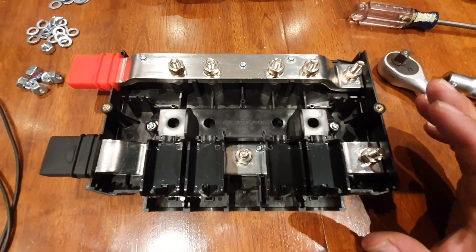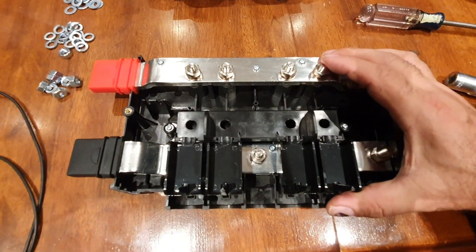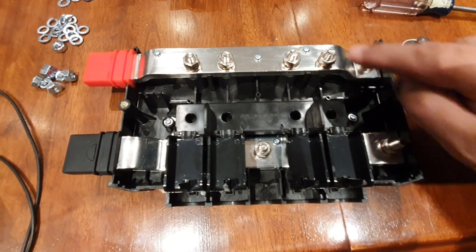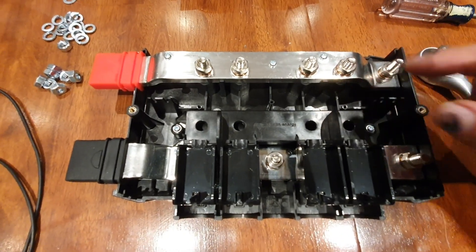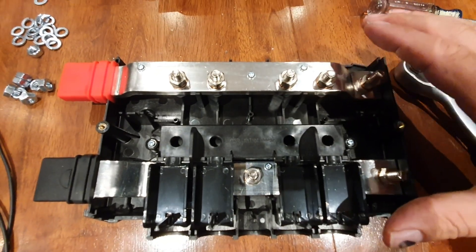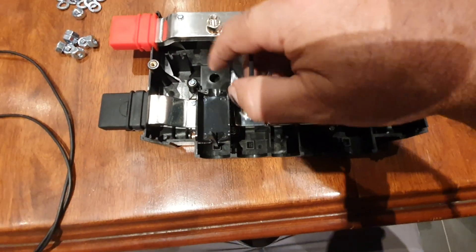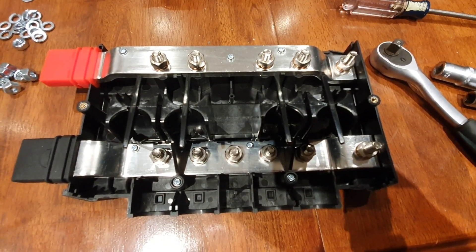Okay, here's the guts of the system, and here's why I say it's a really neat system. You have two bus bars in here — 1,000 amp bus bars. While this particular unit is designed for the cable to lay through here and connect here, this is their Power In, designed this way. The DC distributor has a circuit board and fuses and all that. This is their Lynx Power In — it doesn't come with the ability to have fuses, but they use the same hardware for the DC distributor. So what we do is take these off with four screws, pop those screws, pop this thing off, and you get that hardware in there. Now you've got the ability for fuses. I'm going to pop this open, drop my stuff in there, and then I'll come back and talk about it.